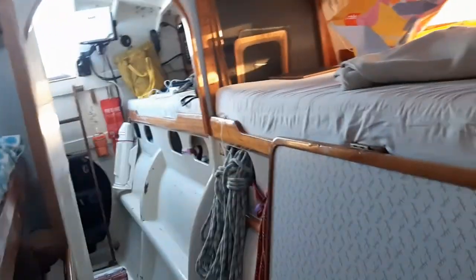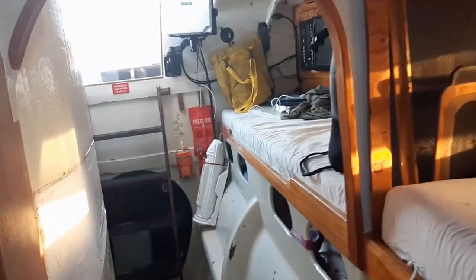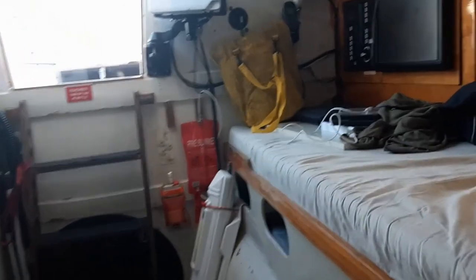And when you go to the front, there's some serious reinforcement to be done on that stringer there. You can see it's pretty fully delaminated there, so the hull is fixed a bit. Yeah, it's been fixed already in some patches, so it's not big, it just has to be done. Probably hatches starting to rot too, some of them. And yeah, so that's the few little jobs I could identify structurally on the boat.